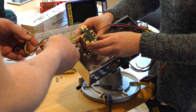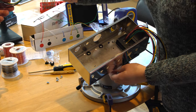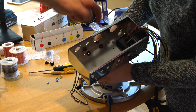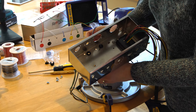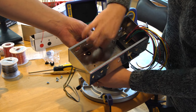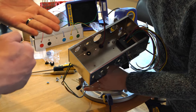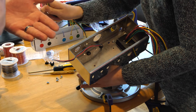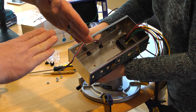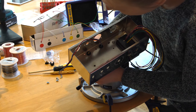The secondary has black for ground and then two other ohm taps. We're going to use the 8 ohm tap — the yellow one is the 4 ohm and the green one is the 8 ohm, but check those because they can differ. Effectively we want the primary side close to the power tube and the secondary side close to the output jack. You also want the laminations of the transformers 90 degrees out of phase with each other so they cancel each other's fields. If one transformer core runs this way, the other runs this way — if they're in phase you'll get a decent amount of hum.